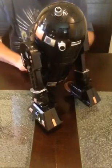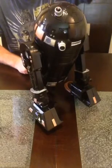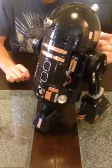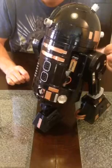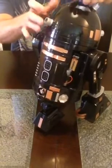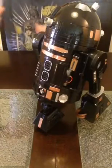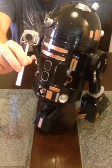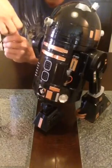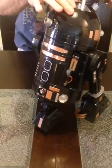The last and final hole made in the top of his dome is this port here. We've connected a 9-volt plug that travels down through the middle of his head and into his left side storage compartment — there's a 9-volt Energizer in there. That 9-volt powers the camera that pops into the top of his head. All you have to do to mount it is pop the original Hasbro piece out, and then the miniature camera goes in. We've modified the post to make it a little wider for a nice snug fit. Remember to take the lens cap off — yes, even this little camera has a lens cap — otherwise you won't see anything. Pop the lens cap off and push it into the top of his dome.